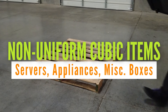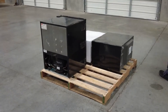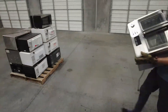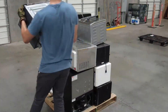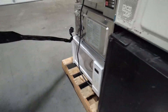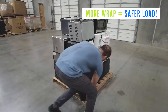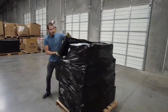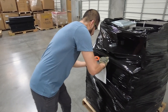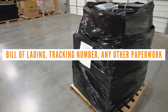Some cubic items are of different sizes but can still be stacked directly onto a pallet and secured with stretch wrap. Begin by arranging the largest and heaviest items as the base, then continue stacking according to size and weight. Ensure there is no overhang and do not stack beyond a safe height. Apply stretch wrap from the bottom to the top and back down again — don't be afraid to be liberal. You won't ever regret applying too much wrap, but the same cannot be said of applying too little. It's better to be safe than to be held responsible. Affix any necessary paperwork in a visible location.